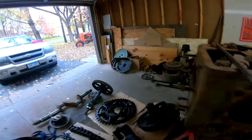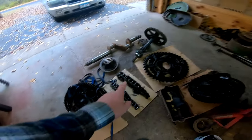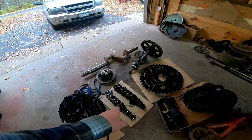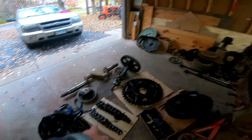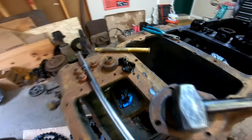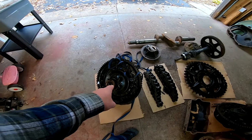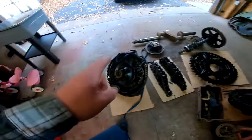I'm probably going to end up using the smaller rear sprockets. These two drive chains are the ones that came out of the 27, so my guess is they have more links in them than the smaller sprockets would need — so these are going to go up for sale. They also have two of the roller collars that I dug out of the bottom of the sludge in the rear case — one chain is missing two of those. But other than that, they're in great shape. We do have to inspect the differential assembly to make sure it isn't cracked like the one out of the 28.